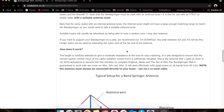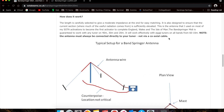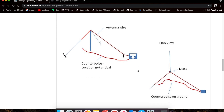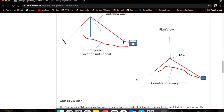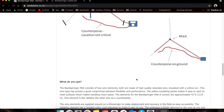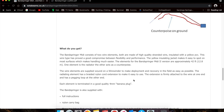It also talks about the pole — I do have the 20-foot SOTA pole from my 20-40 trap dipole, so we'll be using that. One thing to note in the setup: you do need to have this directly connected to your tuner. You can't run coax between your tuner and the antenna, because then you're tuning the antenna plus the coax — an extended length of wire — and you'll be radiating the coax as well, which will give you really weird SWRs.